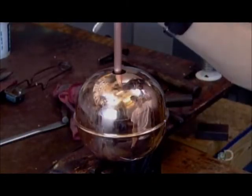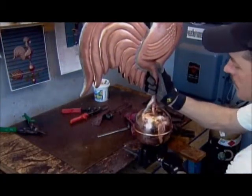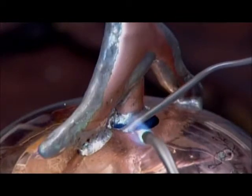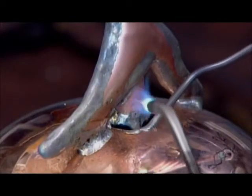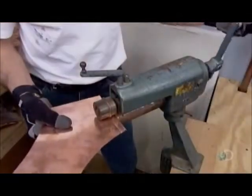For some extra pizzazz, he slides a decorative copper ball up the turning rod, resting it just below the rooster foot, and secures it with solder. He now cuts out the feathered end for an arrow, known as the fletching, which will help balance the weather vane.